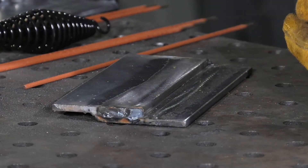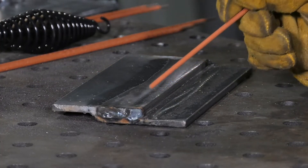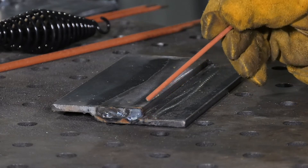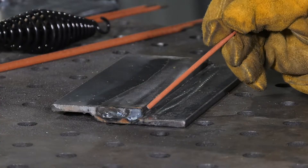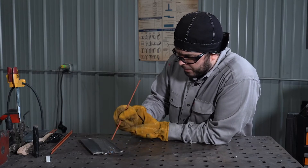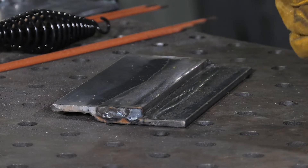Here's the lap weld. Quarter inch thick steel material. I've gone ahead and removed the mill scale. We're going to weld this with the E6010. I'm going to start right off this tack here. Once I strike my arc, I'm going to maintain about an eighth inch arc length and try to make a circular pattern where I'm going to catch the top edge of that molten pool on the top corner of this plate and pull it down into the base plate into the corner and try to catch the root as well. Always maintain a tight arc length so that you're penetrating into the joint root and ensuring that you're getting a sound weld and these two pieces of metal are going to be stuck together permanently.